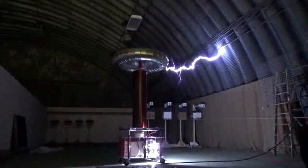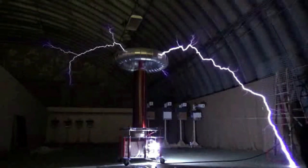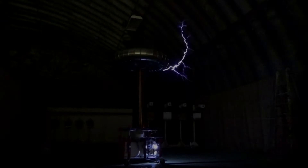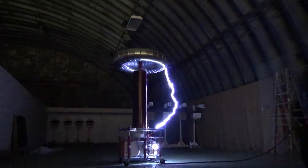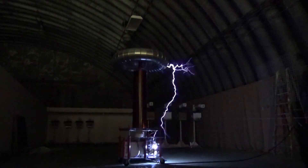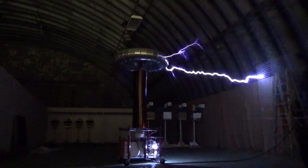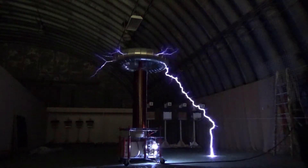This is actually my friend's 12-inch coil that we're running between us. We're still tweaking it — tuning, phase, and final capacitance size — but we're already very impressed with its performance and it's breaking some records. We started off on a low power setting mainly because the safety gap is sitting a little bit too close and has a habit of firing. After we ran it, we measured various strike points as accurately as we could, and a lot of these were about 8 to 10 feet, with several managing 12 feet — which is actually a single coil record for the UK with a 100 bps coil.